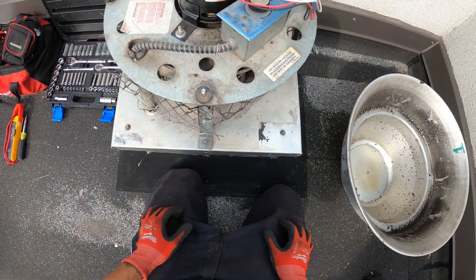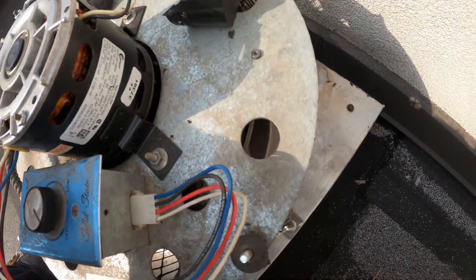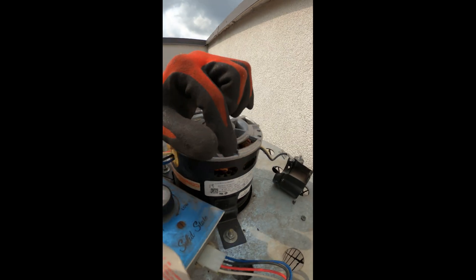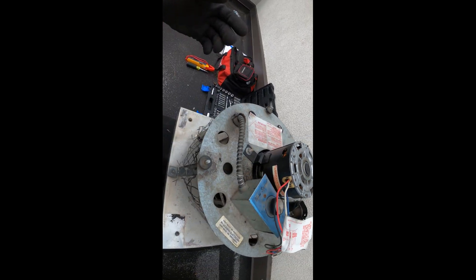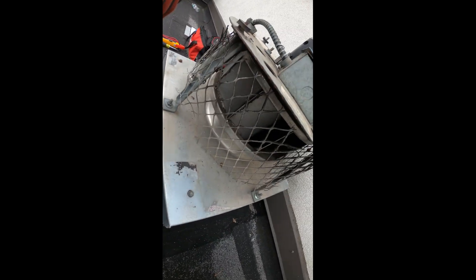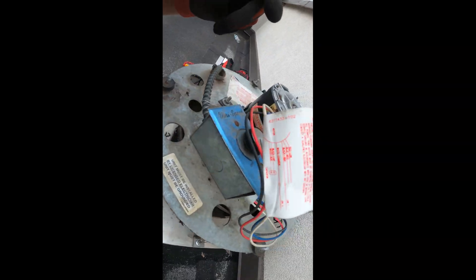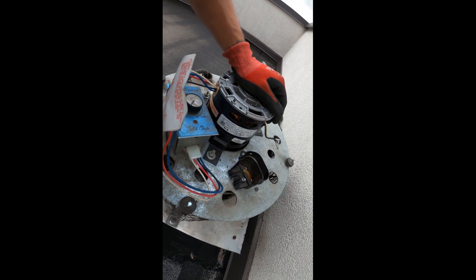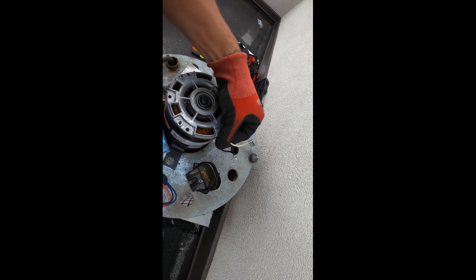We got power on the roof. The motor's trying to start and it needs a capacitor to see if it kick starts. Here's the tag — it's telling me it needs a 10 microfarad capacitor at 370 volts, and that is where these two wires get connected. This was the holder. The fan label is good. This is a speed control — plug and play, seems to be the original setup. We just need to get a 10 microfarad capacitor.